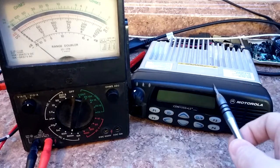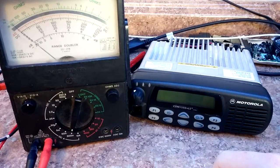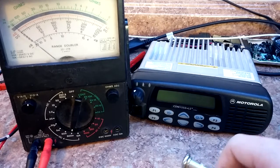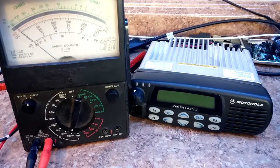The great thing is the UHF ones, which go from 450 to 527 — they're known as range 2 — you can pick up for $50 on eBay, for a 45-watt radio. That's a great price. I've built a few repeaters out of these. They're modifiable — you do have to change your ranges, your code plug, and your tuning values — but it's certainly modifiable. It works nicely for repeaters because it comes down to 440, which is really all you need for ham radio.